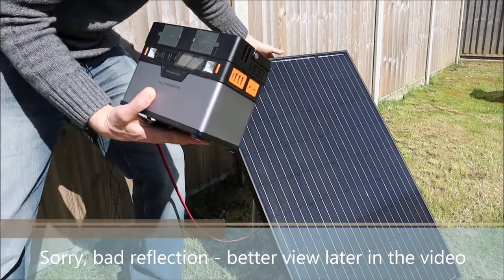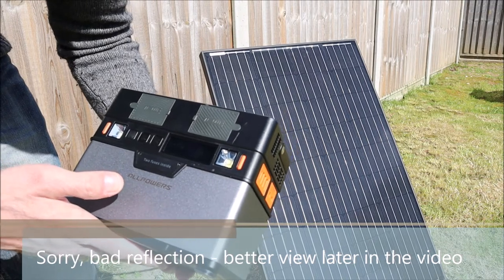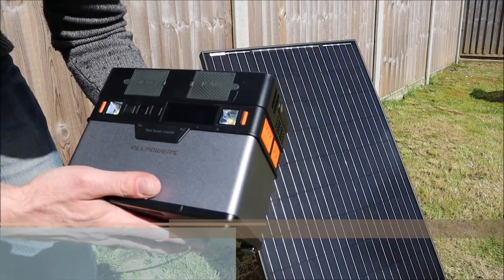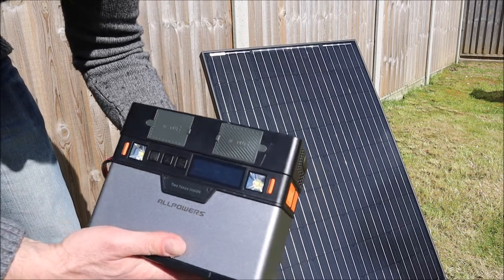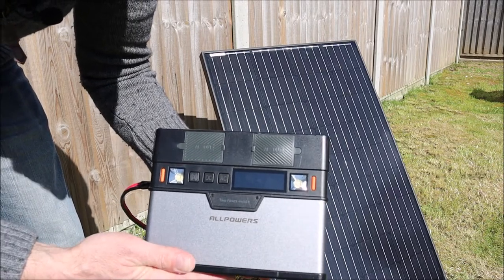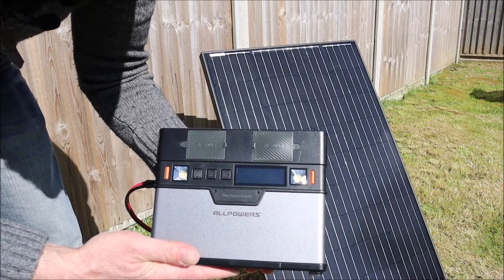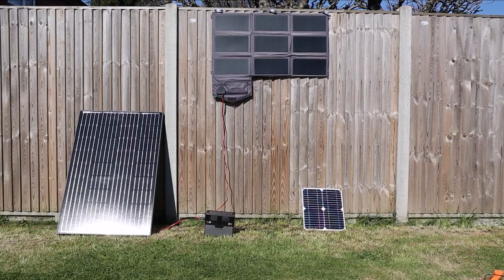Let's see if we can get any more out of that — let's tip it up a bit. It's still at 55 watts. That's amazing, so that must be close to its limit. So even though it's a 100-watt panel, the battery is limiting itself through the MPPT circuit. But that is amazing — we might be able to get a few more watts, closer to 60, out of that. I'll keep testing. It's a successful test!